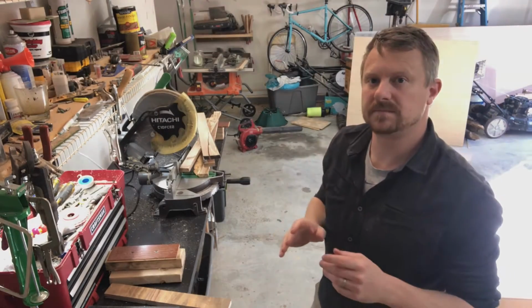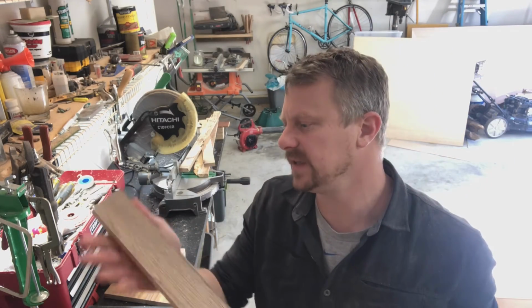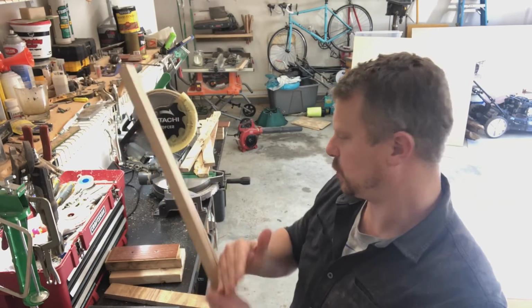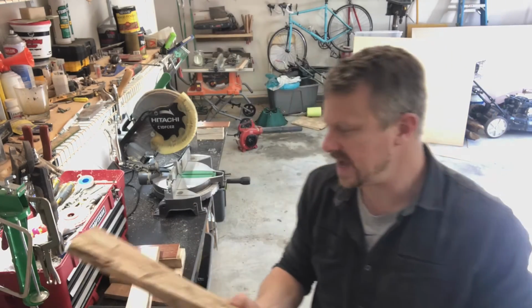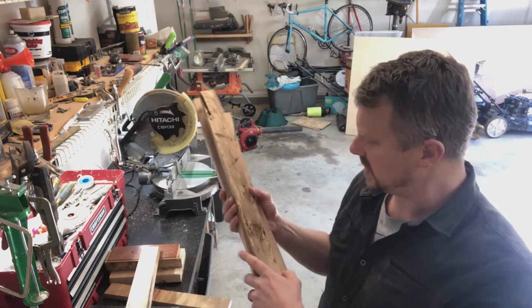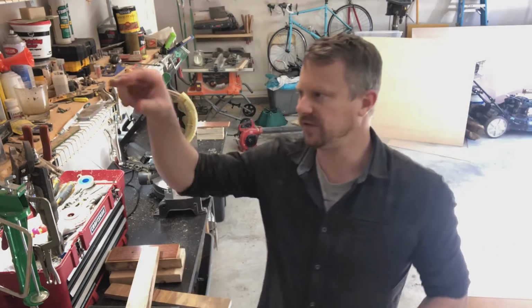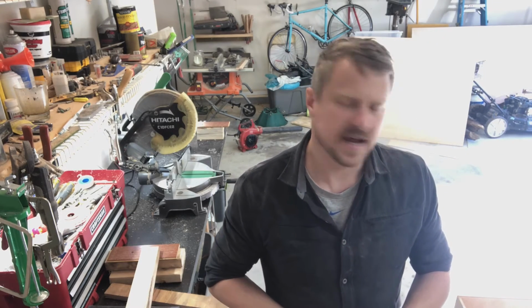Okay, just ate lunch. Did a consult, looked at the closet and some of the other pieces in there. I think I'm going to take this piece of oak that I found and I'm going to mill it down a little bit thinner than this. I'm also going to cut it down and then trim it to shape. These are the actual 3 pieces that I'm going to utilize. I think I'm going to trim it down to this width, and then I'm going to take probably another 1/4 inch out of that. And that is going to go right on the front of that. And then I think I'm pretty well set up to go upstairs and start nailing all of those pieces together.